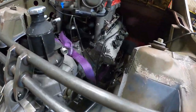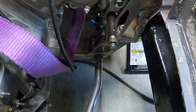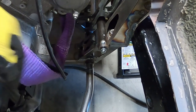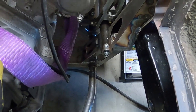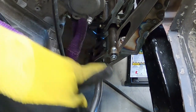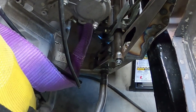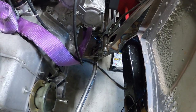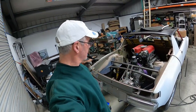But here's really what I was after: it steps down from inch-and-a-quarter to inch. Once that's welded all the way around that second connector and it's a nice-looking TIG weld, that's a sexy transition as far as I'm concerned. It's not a bracket, it's not a jog, it's not anything — it's nice and in line with everything else. Yes, you won't be able to see it, but I'm going to take those style points every time I can.